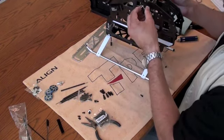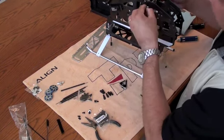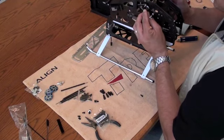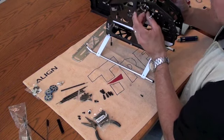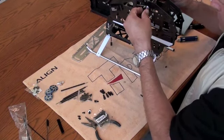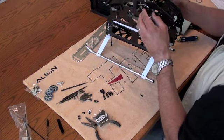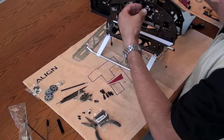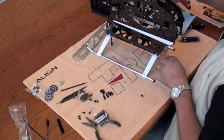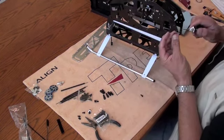And the reason why we're doing that is we don't want to crush the bearing. Okay. So I just want to use the thick. Move the thin to the side. And then we'll go like that, go through. It's a little much. So I'm going to lose the thick, go to the thin. So I've got a thick and a thin here, okay? And that seems to match up much better. Okay, put a little Loctite on this side now that I'm happy with the fit.